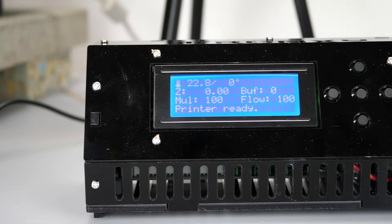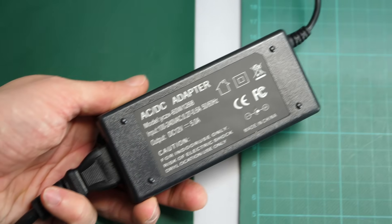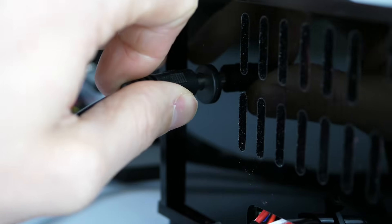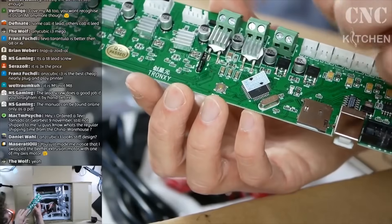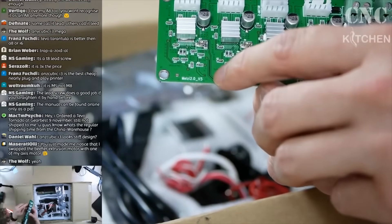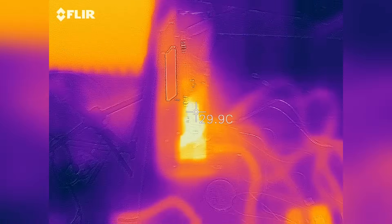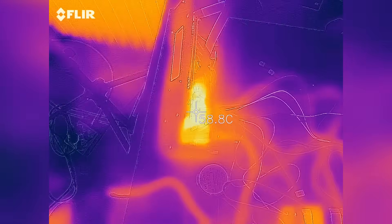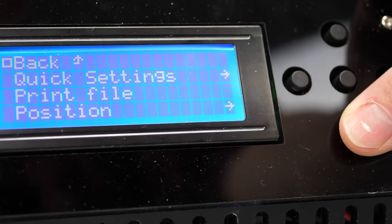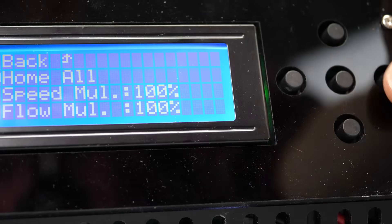The electronics are stored in a separate box which is powered by a laptop power brick. The power supply is great because it doesn't require you to play around with mains voltage and potentially electrocute you. The printer runs on a fully featured Melzi 2.0 board which would allow you to add even a heated bed without huge modifications. Unfortunately there's not a lot of air flowing through the box, so the stepper drivers got pretty warm during printing. The Melzi runs the Repetier firmware, controlled by push buttons which makes navigating through the menus and changing settings a real pain.